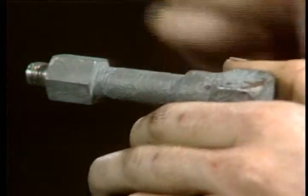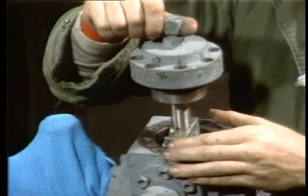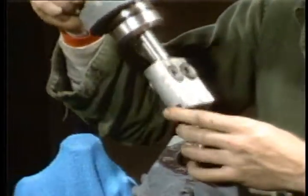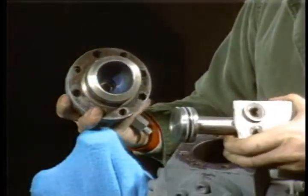Notice the pilot piping on top. This valve is even a fraction simpler than the MKR, since you don't have any springs to adjust. And so these are the only differences. The plunger and plunger guide are slightly different. As we separate them, you can see those differences.